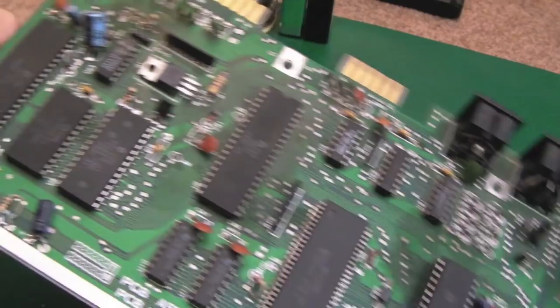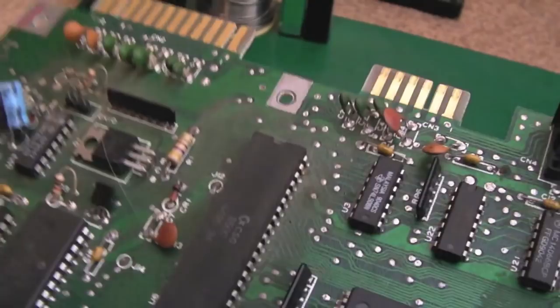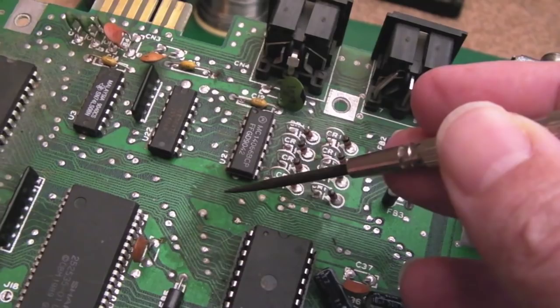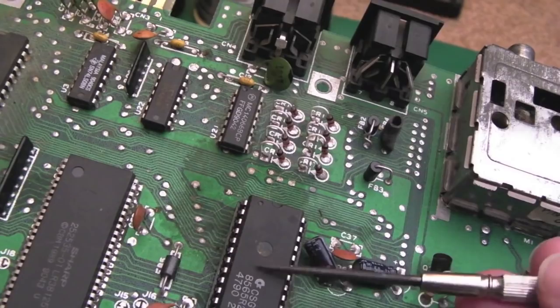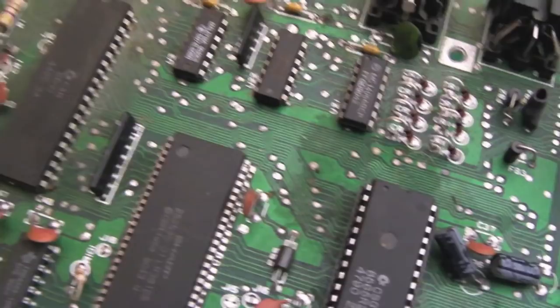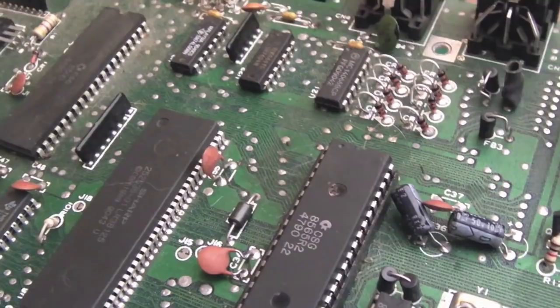Hi, it's Gadget UK here again, just finally getting around to looking at that C64 board I showed a few videos back. Just to first inspection here - this board is real dirty. We've got some corrosion on one or two of the pins there. This area here is particularly dirty, some liquid or something has been spilled over there, so we could have a problem with the VIC-2 socket. It does just look like some liquid has gone around there and it could well start to corrode the pins.